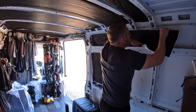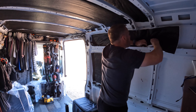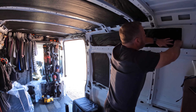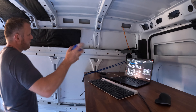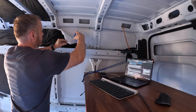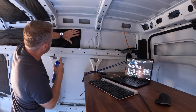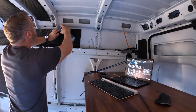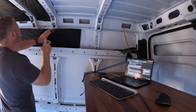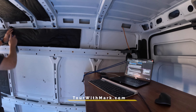You can't really see it, but you'll see my hands kind of fiddling with the cable to get it in front of the insulation. This Loctite is a little quick to stick, so once you stick the insulation down it's kind of stuck, and you might have to rip it apart if you make a mistake — try to get it in the right place the first time. As you can see, this fits in there pretty good. You don't have to be that precise; you can add insulation where you might have a gap or stuff it somewhere where it might be too big and it'll still work. Here I'm just adding a little bit more adhesive to the corners. I just kind of eyeballed it and cut the insulation. If you find this helpful, please subscribe and like the video, leave a comment below and I'll be sure to add more soon.